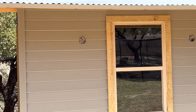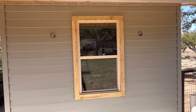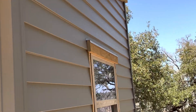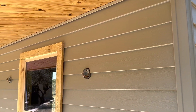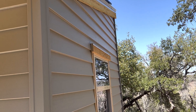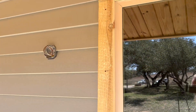The building itself is about finished — all the vinyl siding got installed, and the window trim is done. I still have one window that needs a little bit of trim, and you can see the flashing I put above the windows to shed water off. Where there are porch overhangs I won't do that since we won't get that driving rain. This flashing minimizes water intrusion and keeps water from getting in behind the siding.